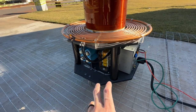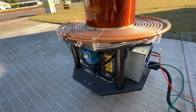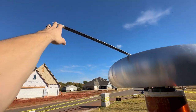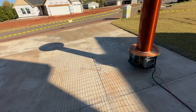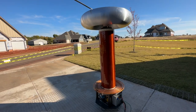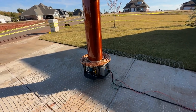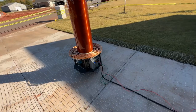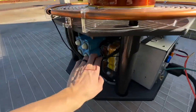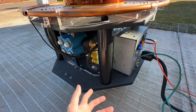In that period of time, we pull somewhere around a megawatt of continuous energy out of this capacitor bank while we are creating the spark. The whole spark, which is going to come off of our breakout point here, is going to form and come down to the counterpoise ground. That spark is anywhere between 10 to 12 feet. It's formed in typically anywhere between 100 and 300 microseconds — very, very fast. Then it'll shut off for a few milliseconds, at which point the big blue capacitor bank down here will recharge from the AC mains power, and it'll be ready for the next shot in a couple of milliseconds.